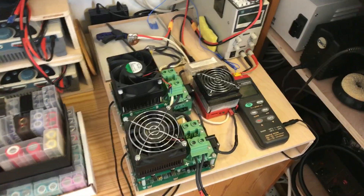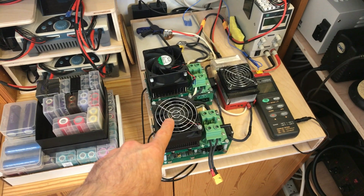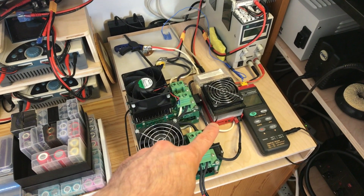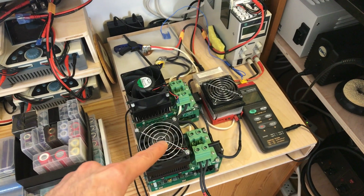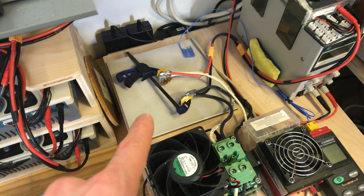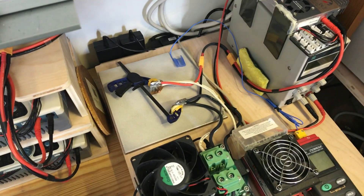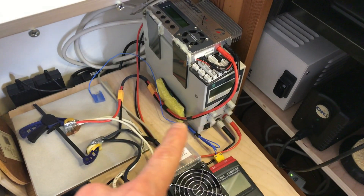This is where the batteries are tested. These are two custom 400-watt, 150-amp electronic loads, so I can do 300 amps with these — not with this 10-gauge cable though, I use a 2-gauge cable. Then this is the West Mountain Radio CBA 4 Pro, a very common analyzer. It takes 10% of the current; these two take 90%. And this runs to what looks like a very janky setup, but it actually works better than a $140 and a $200 quote-professional battery clamp I had purchased from battery testing companies.